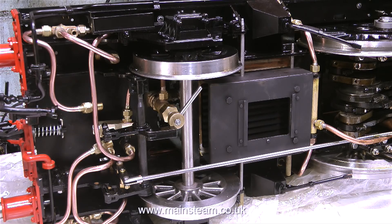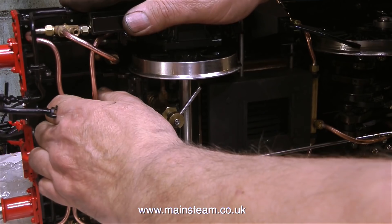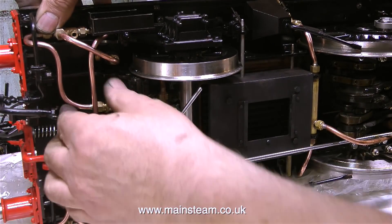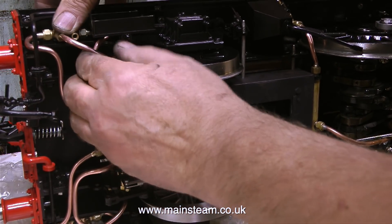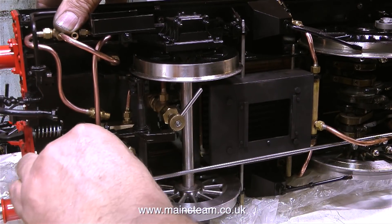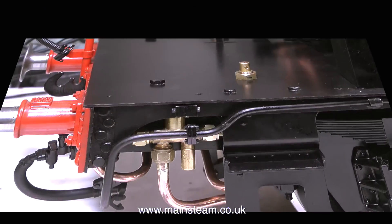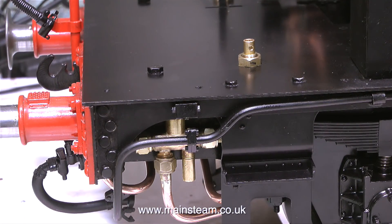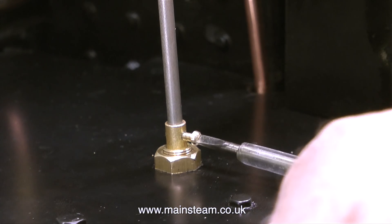Here we have the nearly completed installation — well, half completed really. I'll be bending the pipes to the final setting right at the end. I'm not messing about with them too much because they'll work hard and become very difficult to bend if I do too much. Although these pipes are well out of sight when the engine sits on its wheels, one viewer asked if I was going to paint the piping and injectors black to match the dummy piping — but no, I'm going to leave them copper. The copper will go dark anyway in the fullness of time, and on most miniature steam locomotives I work on, the piping is just left in copper.